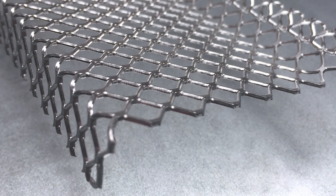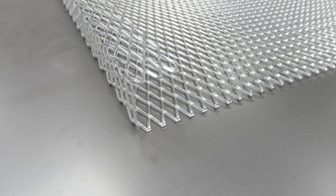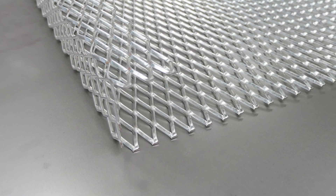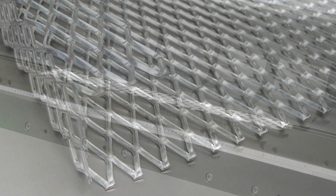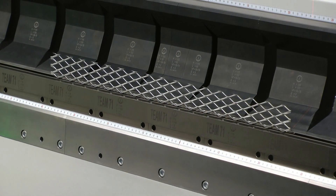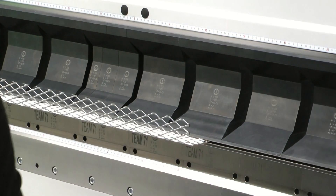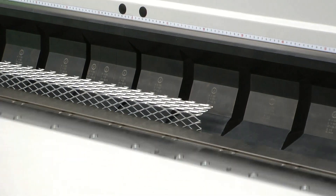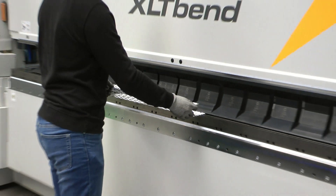The situation is similar with expanded metal. Since the material is first cut, then stretched, the ability to keep the sharp-edged material on the back gauge table makes handling much easier. However, the position of the material during bending remains critical. If your bend line alternates between the material nodes and open spaces, the bending angle varies considerably due to the differing material behavior.